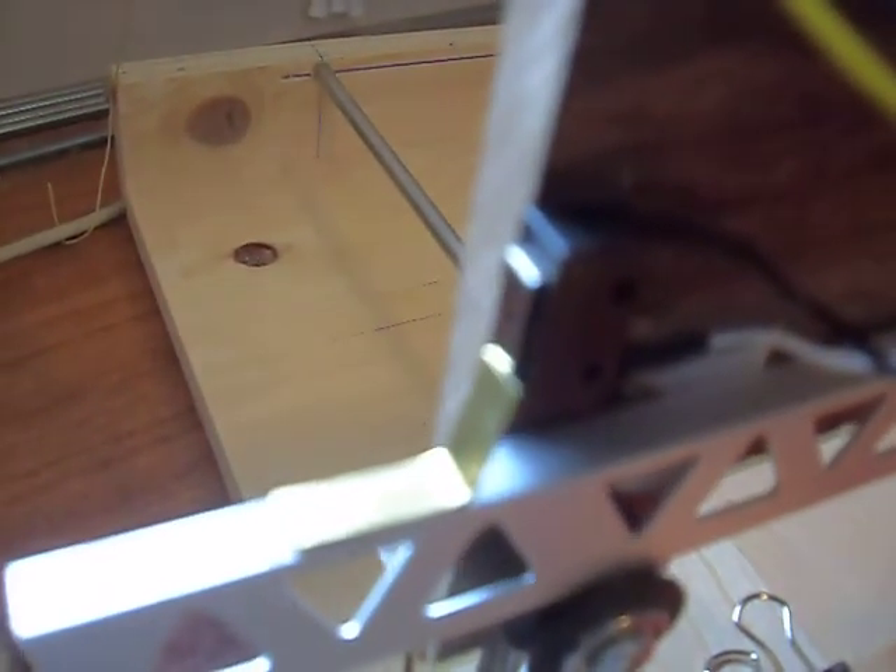Here's my end stop. This is my Y-axis — same deal here. I used the aluminum edging and glued it right to the platform. The Y-axis motor is actually crazy-glued to the base. Don't laugh — it really works well. I've got a tensioner on this side made of silicone tubing, with a screw in each end and an idler wheel that pushes each of it.